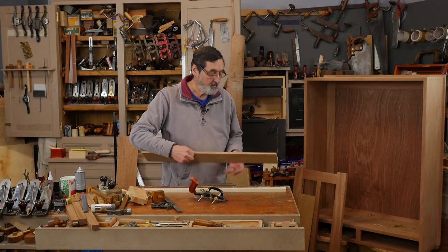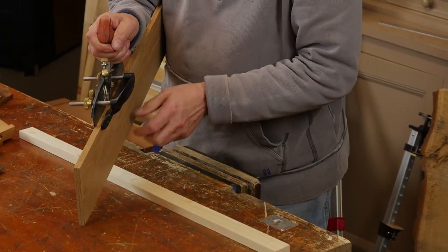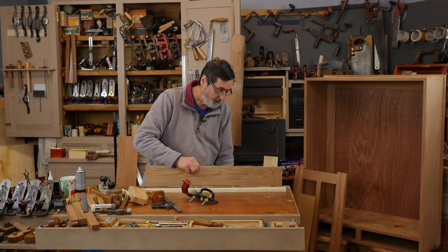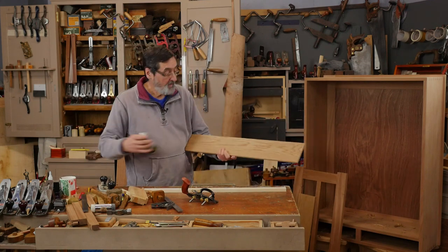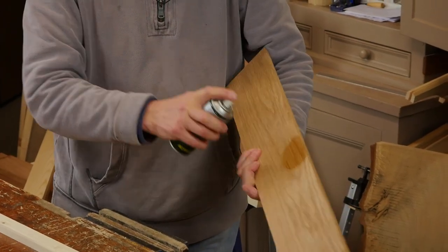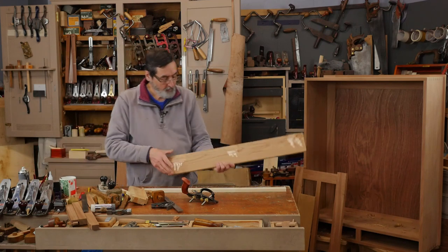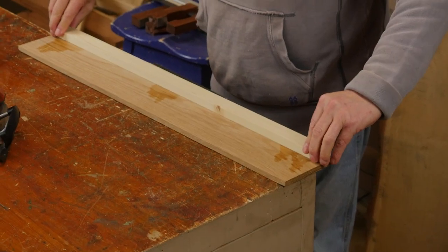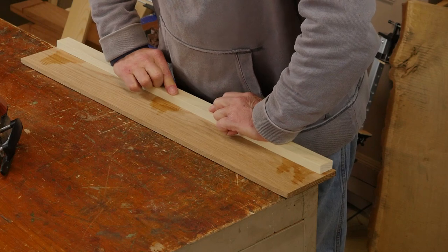And then a little bit, so I'm going to actually take out the back edge of this here. This is my front face. This is how it's going to go in my panel down there, in my frame down there. So what I do is I just take a dab of the super glue, and here I'm putting some accelerator on here, just like this. That will meet those points. Bring this over and just flush it with the edge of the panel. Give it 2 seconds to grab.